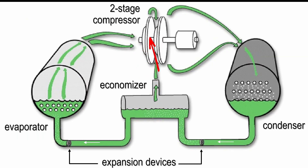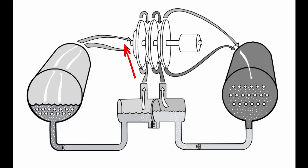To give you another view of what those impellers are: this is our suction line and this open area here coming into our impellers. These are the impellers — this is your rotor and your shaft. Your first stage guide vane would be here, first stage impeller, and you'd have a second stage guide vane here — this being a two-impeller CVH-F. And this is the same schematic but for a CVH-E or G series: your first stage IGV going into your first stage impeller, a fixed guide vane for your second stage, flowing into a variable guide vane for your third stage, and then out your discharge line into your condenser.